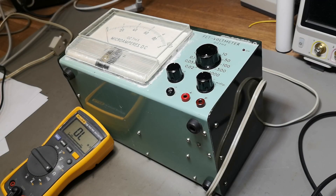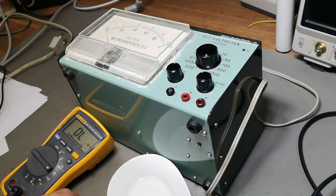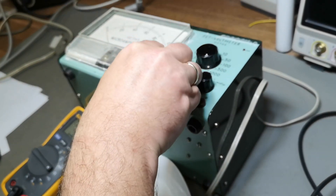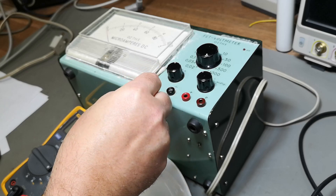Here is my idea: take a little bit of water. Let's first try and take one of these, dip it into the water, and then put it on the table. Let's take the ohm meter — so it's three or four hundred kilo ohms and the distance is about three millimeters. Okay, let's take the other end and see if we can take a little bit of this and dip it. If this is salt it should be fairly conducting, right?